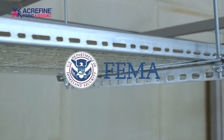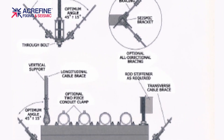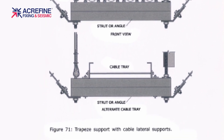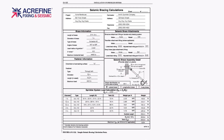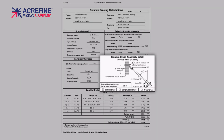Because cable bracing is a tension-only system, there have to be bracing kits on both sides of the support. This feature allows for a very practical selection, regardless of the cable length. The engineer has to perform one single calculation to confirm the tension force is within acceptable limits. On the other hand, for rigid bracing, both tension and compression calculations are required for every single brace length.